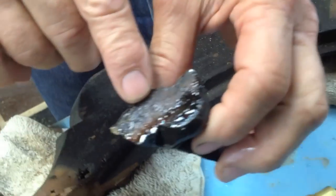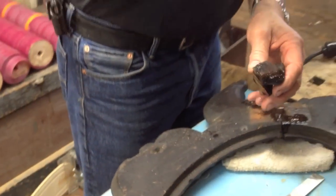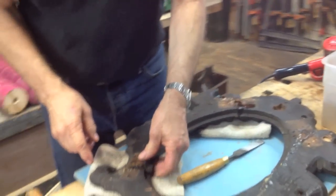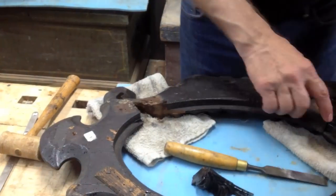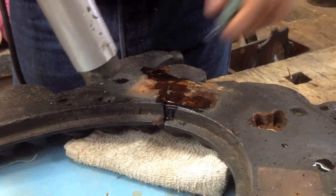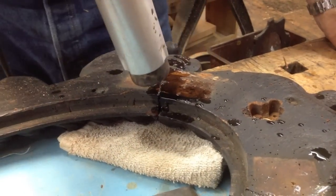There — now this has a coating of glue which I can just rehydrate with some fresh water. I'll put fresh glue on it, reposition this, and it'll be fine once I get it back in place. It's just a question of having the heat and the moisture at the glue, and then once it liquefies you can break the joint open.